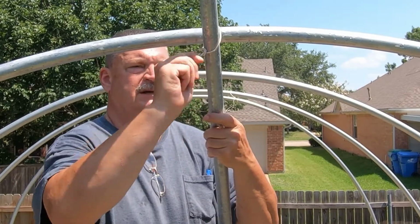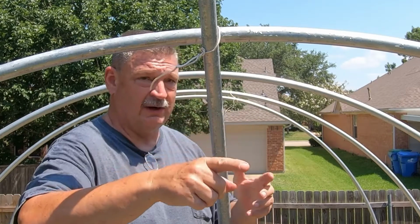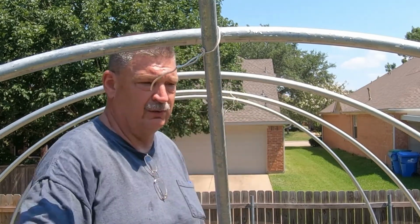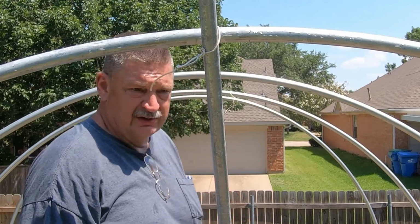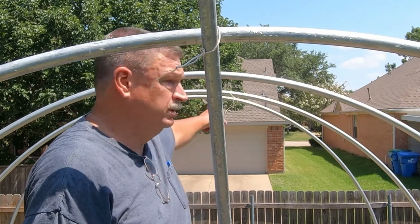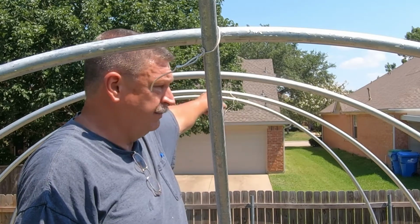And the piece going up here is shorter. It's not going to reach that, because when I lift it up at the other end, if it's sticking out too long, it's going to hit the top of that bow. So I'll just move back, and you probably won't be able to hear me, so you can just watch what I'm doing. I'm going to do the same thing on this 3rd bow, 1, 2, 3, the 4th bow. I'm going to wire it up there, and then I'll come in and put my purlin clamp here.